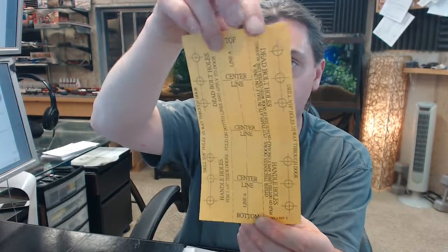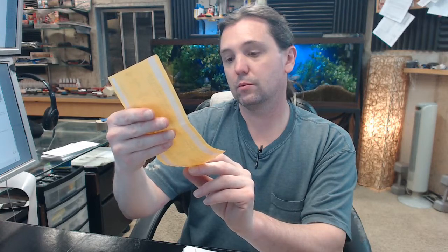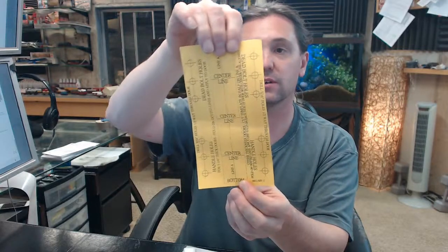So you're going to have your template, and along the vertical dashed line, depending on the hand of your door, you will fold that over. Okay? And the template will go on the door, and this will go up to the edge of the trim of your door. So on the inside of the door, this door swings out. You're on the inside. Okay? That dashed line is going to bump up to whatever the stop is. Whatever sort of surface that your strike is going to have to contend with is where that will be installed. Okay? So I see the template as symmetrical. Turn it over either way. However, this is marked top, so whatever hand of the door you have will be the leg of this that you're going to use. Okay?